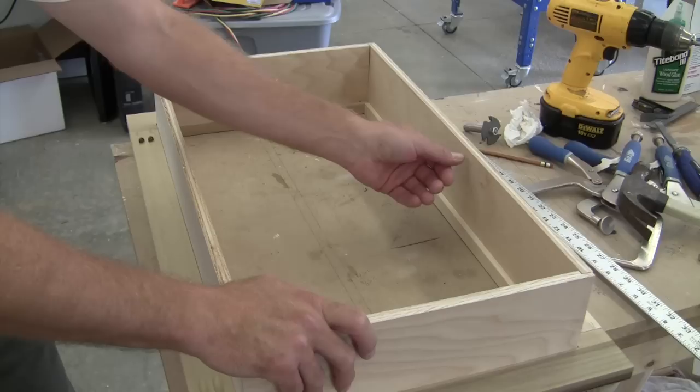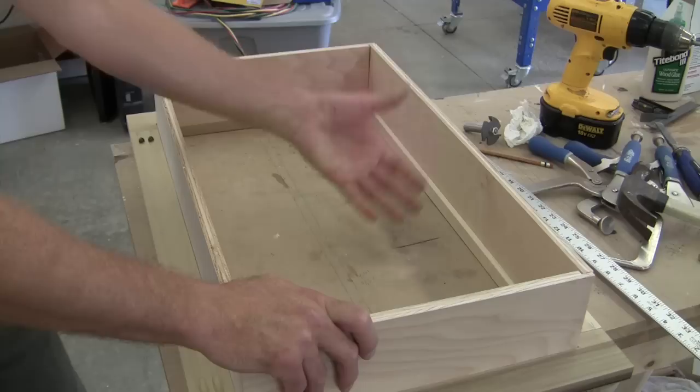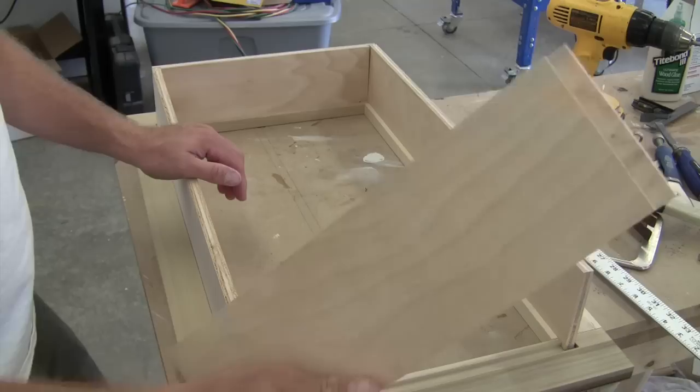The other thing I don't want to do is come in a quarter of an inch and cut a half inch slot and slide it in like I do with the quarter inch plywood, because then I'll be giving up this precious interior space. So what I'm going to try — I've never tried this before, I think it's going to work fine — is go ahead and cut a rabbet around the perimeter, just kind of like we did on the ends here.